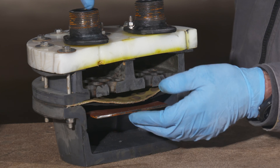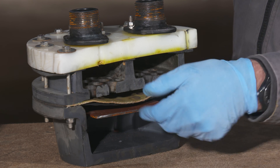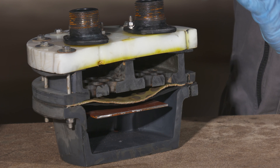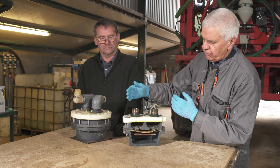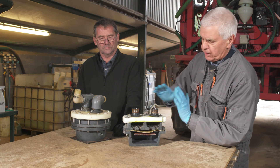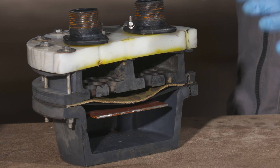The flow through here is governed by the pressure in the system — it's in the return. So if you want your sprayer to work at two bars, you have two bar pressure in the air chamber, and irrespective of how many sections you've got working, it will compensate. This diaphragm will shift to alter the flow, and all the nozzles that are working will spray at that two bar pressure.